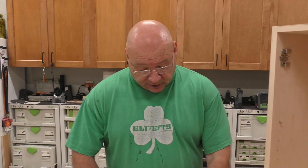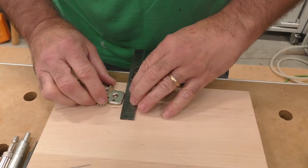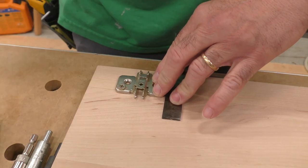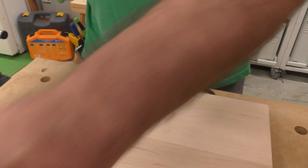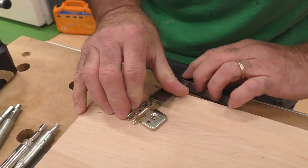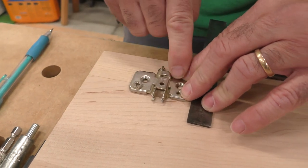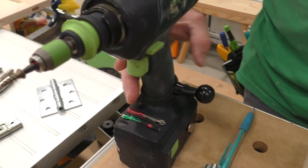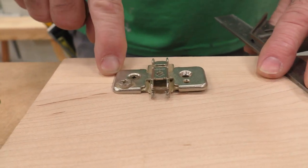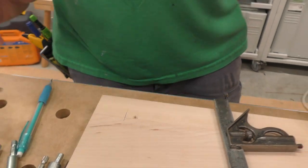What I've seen — and done myself over the years — is setting hinge plates by measuring a line and using a square. And it's really weird: I used to just take a screw, put it in the hole to make a mark, but you'll see there's a taper on these screws. If you just press it in like this, watch — it pulls off-center. So that's not good.